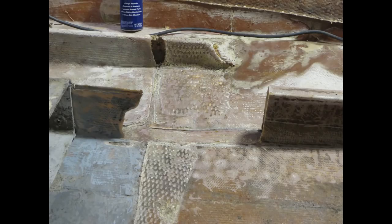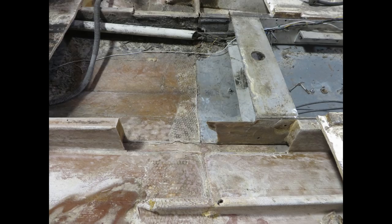It's Saturday morning and I'm starting the day off grinding and cutting fiberglass. I've cut away the rotten stringer up to the point where I'm getting sawdust when cutting — that's the telltale sign: when you get sawdust, you're into good wood. But most of this was rotten. I'm trying to retain some of the glass along the motor mount, and I removed the motor mount bolts to do this. I'm going to cut a replacement section in here, doing one stringer at a time to help maintain hull shape.